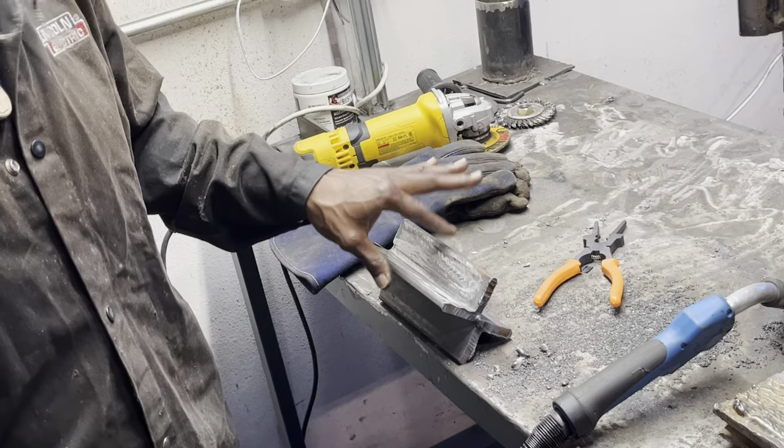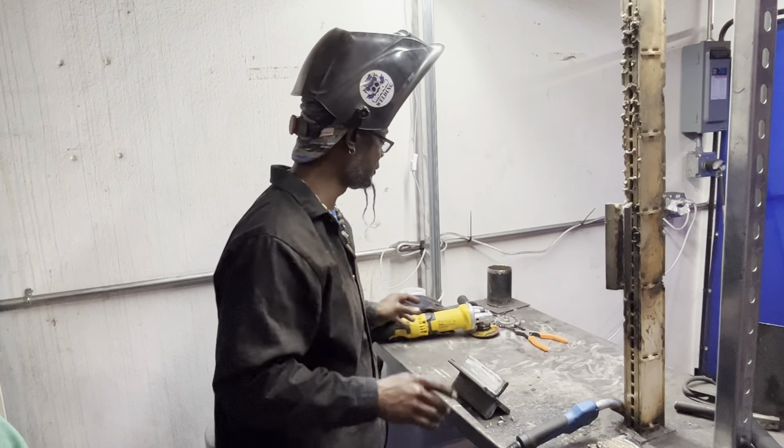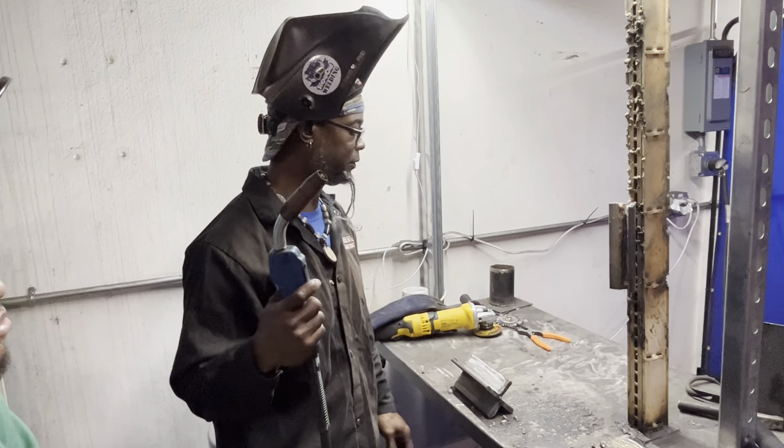The goal is to build stack beads. As you start welding, you drop one bead, tie it into the toe of the next one, drop that one then tie it into the toe of the next — it's the same process. The difference from stick welding is you don't have to push down anymore or hold the rod as it disappears. With flux core the wire is coming out on its own.